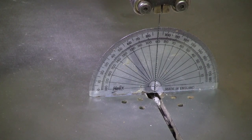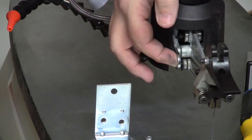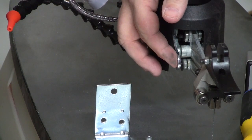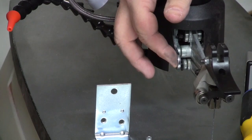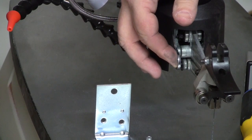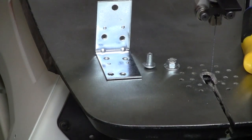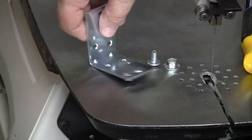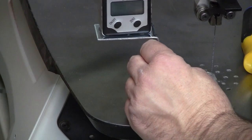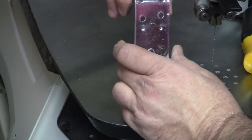I'm going to zoom back out here for a second and show you how I installed this bracket and what I used for this project. You have to remove the hold-down foot, which goes in this little bracket right here. I never used the hold-down foot anyway, so it was not a problem for me to lose that feature. I know most people do take it off because they get in the way, but if you do use the hold-down foot you may not want to do this or find another way to mount it. What we use here is a two-and-a-quarter inch right-angle bracket that I got at Home Depot — that is what the Wixie guide is going to mount onto, and the Wixie guide has magnets on the bottom so it stays pretty steady.